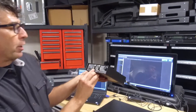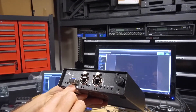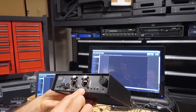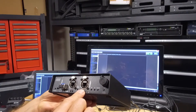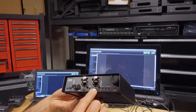It can be powered over ethernet or fiber. If you're powering it via LC fiber, you need to power it with an external power supply. You can loop through power over ethernet and connect up to eight radio transceivers. Each path can be no longer than 100 meters or 330 feet for power over ethernet, or a lot longer via fiber.